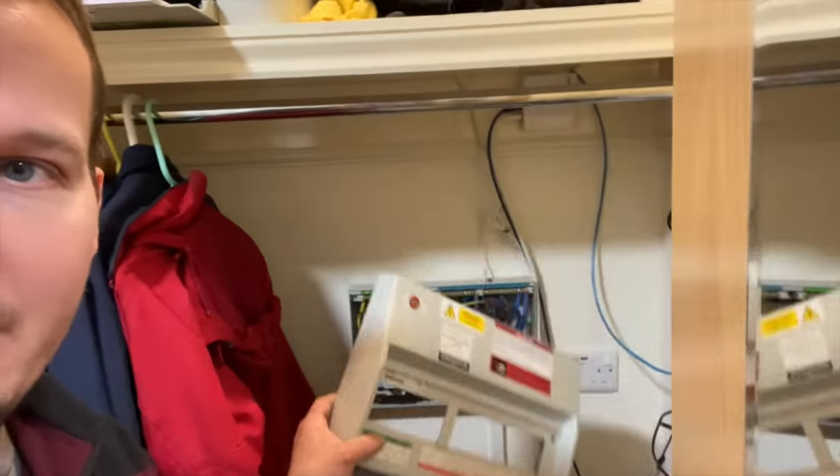These are obviously the other flats, and then you've got the communal area just powering the lighting and sockets in the communal area. So what we've got: we've got to go off and make some comments about this. With this sub-main running in twin and earth, I'm going to ring the NIC technical helpline to ask about the 63A MCB protecting the 16mm tails. The issue is it's an unprotected cable — it should be in conduit or steel wire armoured — and it runs in the fabric of the building.